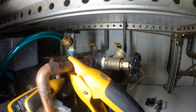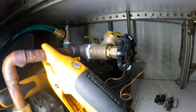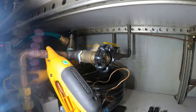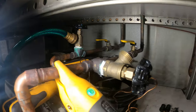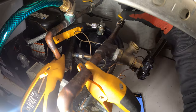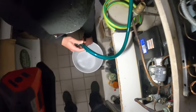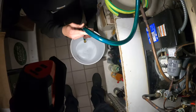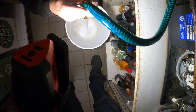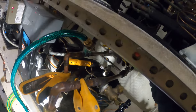On a previous service call in this building, I found a piece of the cooling tower inside the water piping. There is no strainer to catch debris for this machine. I want to flush out the system using the garden hose connections on the water lines. I'll close this side and open the other one — there's some pressure there.